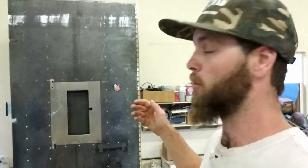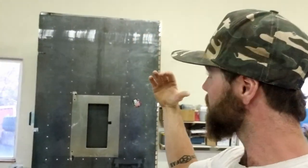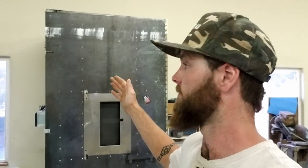To actually get it out, we had to put a floor jack and jack the trusses up enough to shove this thing up into the ceiling, get it to rotate, and pull it out. In case you haven't seen this thing before, I'll do a quick run-through on how it was built. Basically, I just framed together a 4x8 box out of 20-gauge steel studs, laid normal pink fiberglass insulation minus the paper in between the studs, then sheeted it on the outside and inside with 18-gauge sheet metal, screwed together with self-tapping screws.